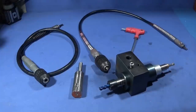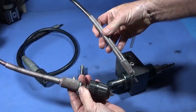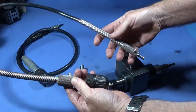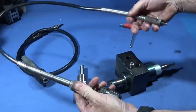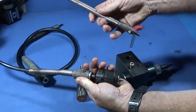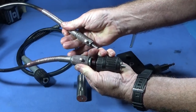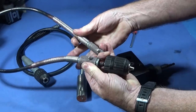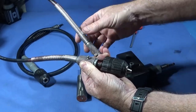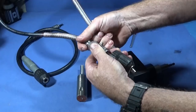Before I show you in the workshop, I'd just like to say that you can get these heavy duty flexi shafts for drills on eBay. The lighter weight ones wouldn't be able to operate this — they'd probably snap the internal part. The heavy duty ones to go for are the ones with the oil or grease nipple in each end. What I do is unscrew both of those, put it upright, and put some ISO 32 hydraulic oil in with my oil can and squirt that into the shaft.